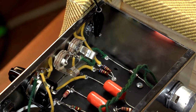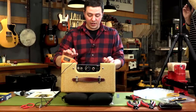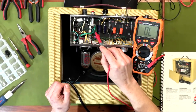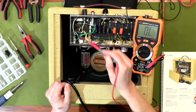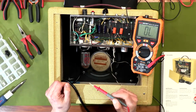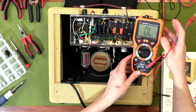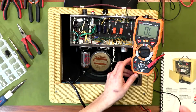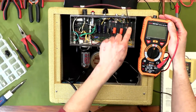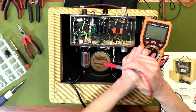Ground is connected to the green AC cord, and essentially it's anywhere in this chassis that's got a mounting bolt. These terminal strips are ground. For our purposes and so we can see what I'm doing on camera, I'm going to clip it onto one of these mounting bolts up here through the cabinet. For anyone following along throughout the entire series, this is a review of the safety tips from episode one where we demonstrated the snuffer stick.